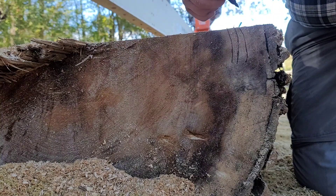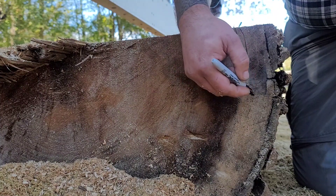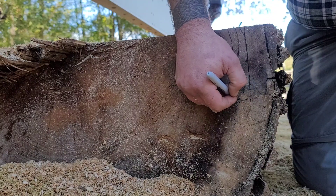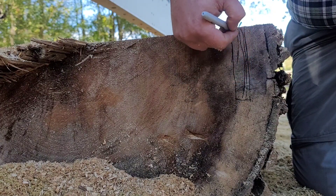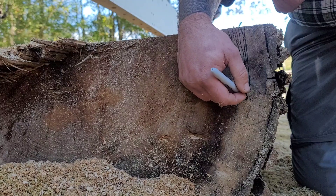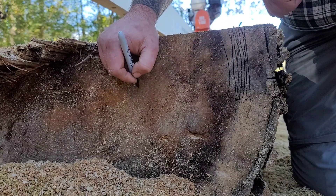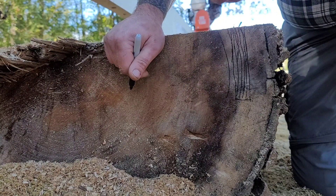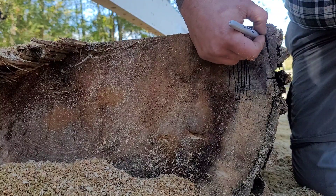Up until this point I have been cutting over one inch and down one inch, making one-by-sixes. So if I did that on this piece and cut a two-by-six, all these growth rings are going to be oriented like this. And what that's going to do — you can see how all those rings are pointed in one direction — this wood as it dries is going to pull up on both sides and basically make a big horseshoe. Obviously if you're making a table or building anything, you don't want your wood to be cupped, because then when you try to get it flat on a planer or build something, you're not going to be able to get a good true corner.